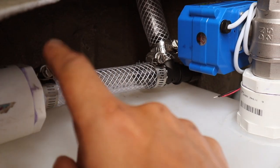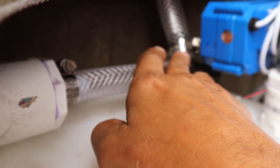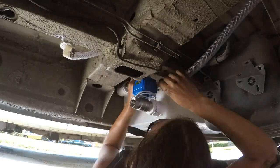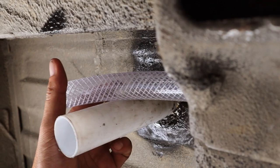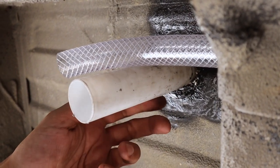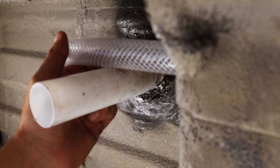We're definitely going to strap this down. I just tightened up these three hose clamps — you want to make sure you're able to have access to them again, so tighten them in a position where you can get back to them. Now all the hoses are connected. The scariest part is I have to cut right here into this drainage pipe, connect a PVC fitting, and make a 90-degree turn. Somewhere right around there is where I'm making the cut.